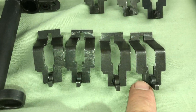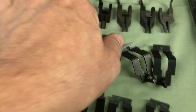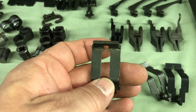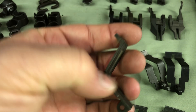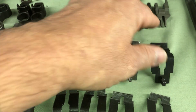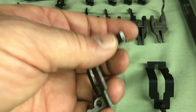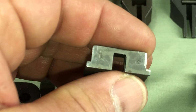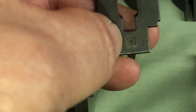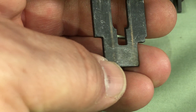Here's a Springfield one - forged. Notice the difference at the bottom: they don't have that cone-looking thing. Some had marks on the top. Then they went to one with marks at Springfield, and on the corners they got little dents on the left and right side at the bends - that's still forged. These are stamped and put together. You'll notice there's a little fingernail cut off on the side, the metal over here was folded - see the fold line - and they were brazed together. At the bottom it's got a square. This one's called a starburst - that's International Harvester.